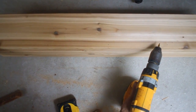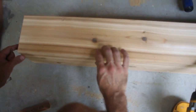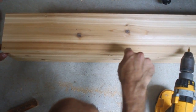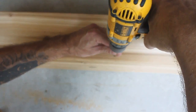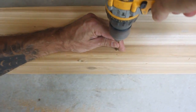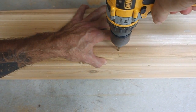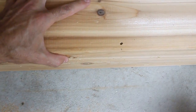I'm just touching my edges here to make sure I'm lined up nicely and it's smooth. I want to look down from the top and make sure the board on the bottom isn't sticking out — it looks pretty good. I'm going to put a screw right in the middle, straight down into the other board, going really slow to lessen the chances of the wood splitting. I've countersunk it just a little bit. I put the rest of the screws in for this side and I'm going to do the exact same thing for the other side.